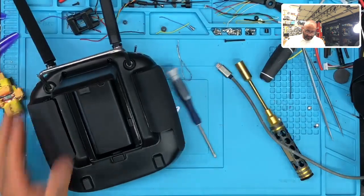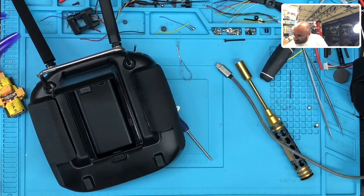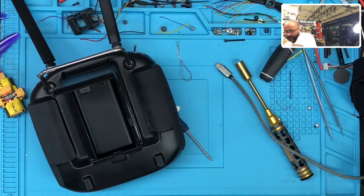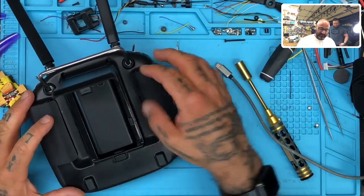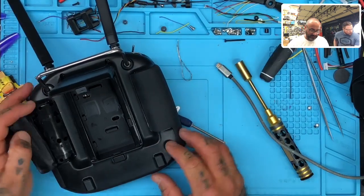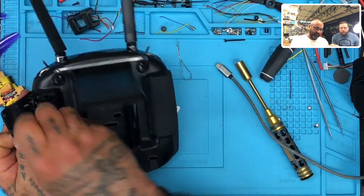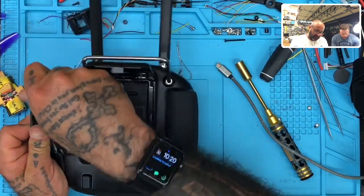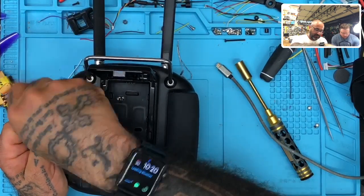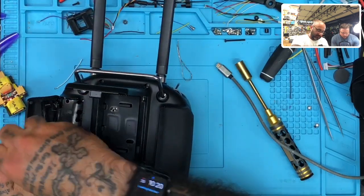All right. Okay, so what Justin is saying is that you can feel the teeth, the clicks, I guess, when you're moving the throttle, and he wants to reduce that. So basically reduce the tension. So what we're going to do is go ahead and open it back up, and this is something I probably should have adjusted before I closed it. So I'm going to let him try that before we close it the next time. So we're just going to go ahead and feel that out.